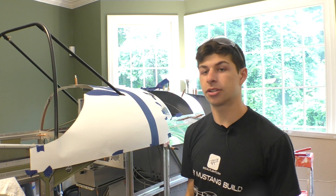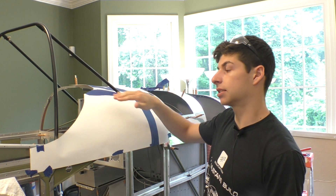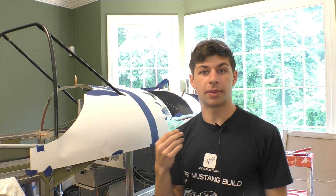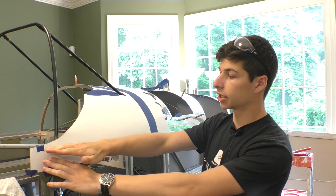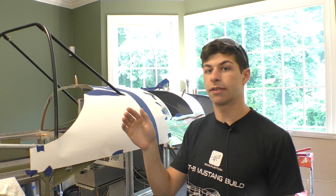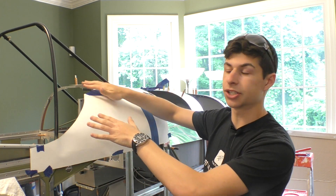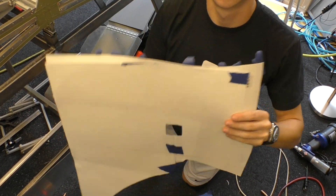This piece has some interesting curves, and what we're going to do is change the curve a little bit to give us more clearance for an LED light strip that we're going to put in. That strip will be able to glow up things like our switches and different controls. We're going to make the curve tighter until we're three-fourths of an inch away from our panel, which sits right down here. That will give us enough clearance for the LED lighting strip — a really nice clean curve right under the glare shield.